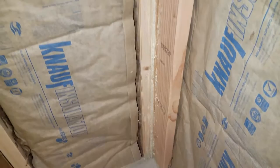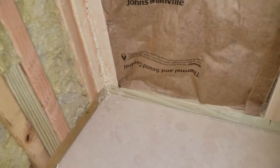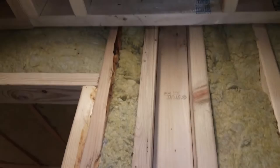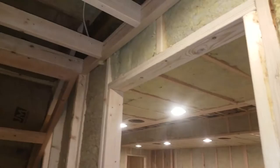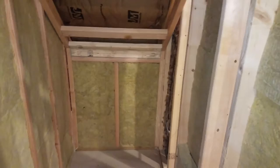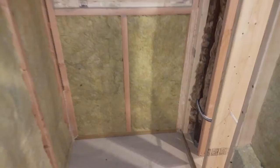I guess I could have probably left it, but I thought maybe bugs or something were going to get in there and work their way down to the baseboard and get in from where the carpet meets the ground — there would be way too big a gap there. Then I just tried to pack insulation in everywhere I could. I didn't get behind this stud; I probably won't bother with that. I did run out of insulation, so there are a few areas I'm going to have to come back and revisit. And I did some expanding foam again down at these seams, just to seal that shut.